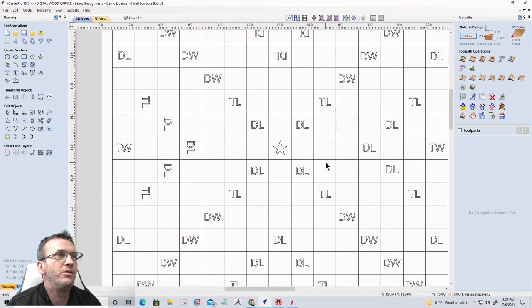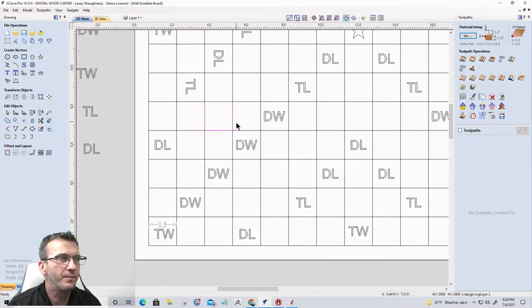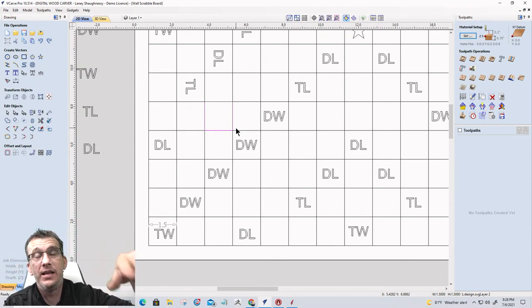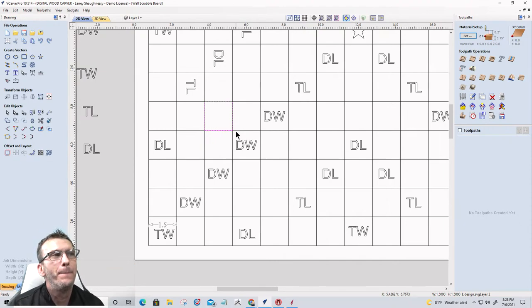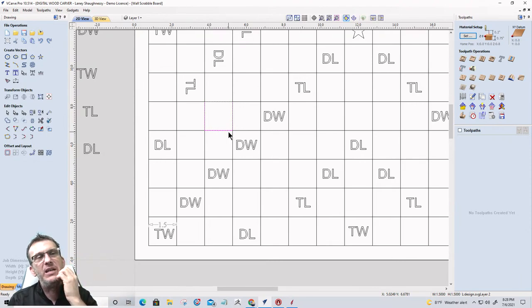So these are all gonna be V carved. Our individual rectangles, I'm pretty much using them to help me lay out this area. But I'm gonna use a V-bit and do a profile cut, cutting on the line, because I'm basically just gonna create a little outline grid, a shallow cut, maybe a 16th of an inch deep or what have you, outlining all these rectangles. And I don't want my V-bit to go around all four sides, all four sides, all four sides, and do that 225 times.